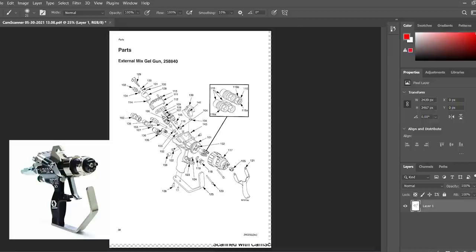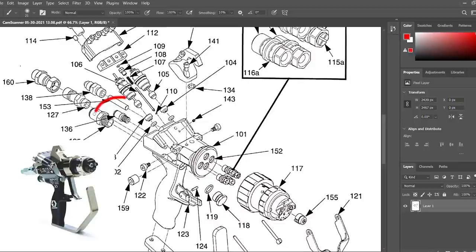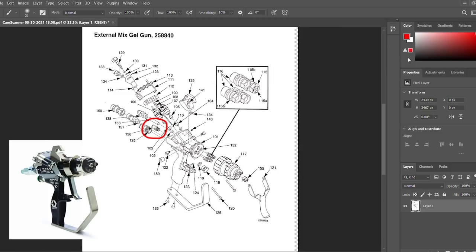The problem was getting it out — it turned out to require an allen key, and I had to find one long enough to reach inside the back of the gun. The fitting itself had no nut surface, no ability to undo it other than an allen key. Once I removed it, it definitely wasn't sealing on the airline coming out of my machine, so the catalyst stream isn't atomizing as it's supposed to. In fact, the whole gel coat of the deck was a touch of good luck given this.